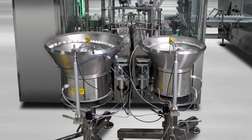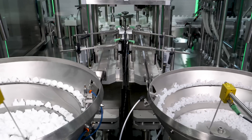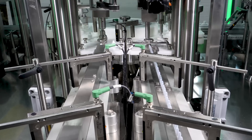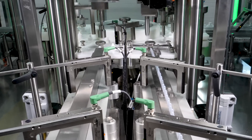The Aquarius Monoblock utilizes separate vibratory bowls to sort and orient caps and plugs from bulk. Once sorted, they are fed in vibratory linear tracks toward the plug and cap star wheels. Sensors control the feed of components in the linear track.